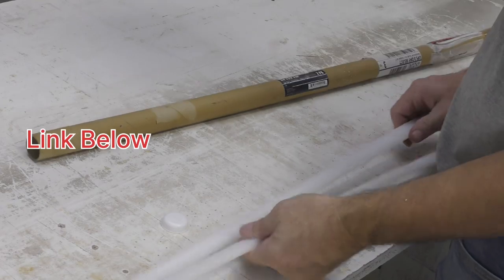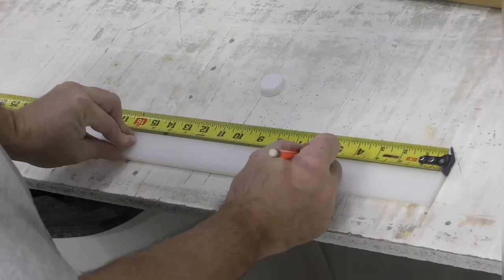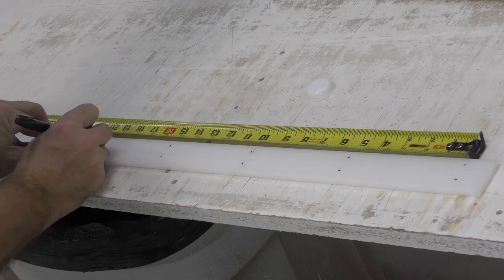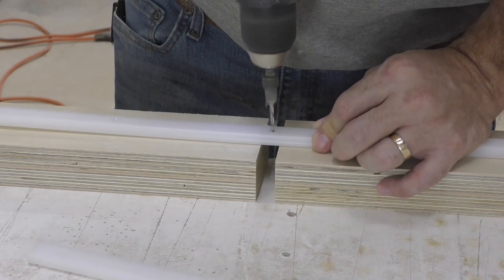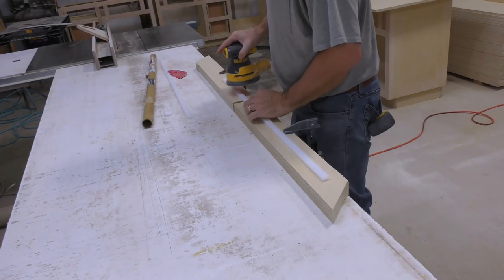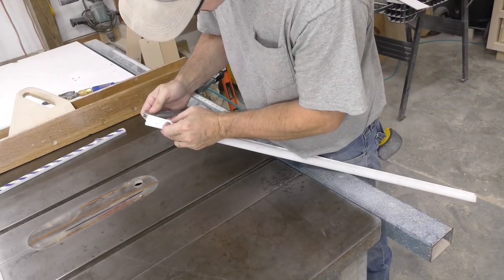Our last parts to prep are the HDPE slide bars — they'll need to be cut down to 34 and a half inches. Then I'll mark them every five inches for screw locations, and FYI, use a Sharpie. We'll use the drops from our fences to create a gap and use a countersink bit to prep for three-quarter-inch screws. We'll sand off the burrs and stick on some double-sided tape — I had some one-inch FastCap tape laying around so I'll have to trim the edges.